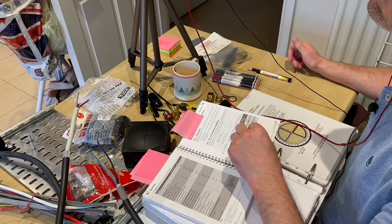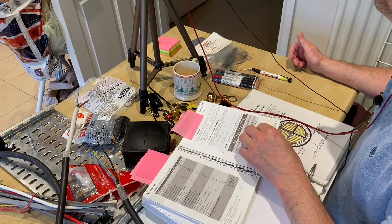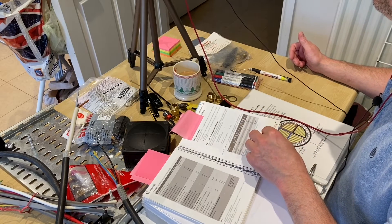Can you look in your appendix for the appropriate section on interfacing of cables? Where we're joining an old cable and a new cable together, there were some precautions when interfacing three-phase and three-phase and neutral conductors together - so three lines and neutral. Has anyone found that appendix? Yes - appendix 6.